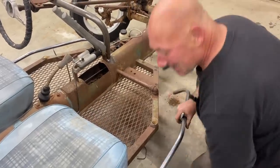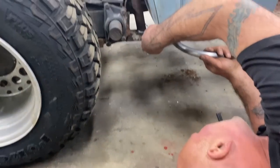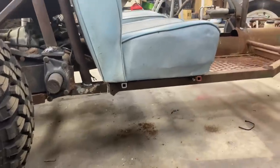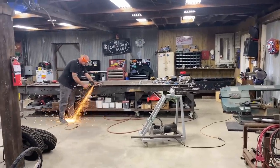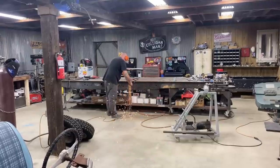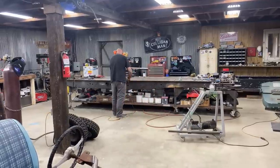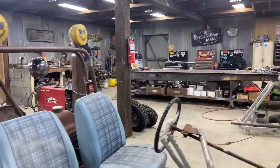like so. Then I'm gonna get under here because we got some big old lug of steel in our way. Let's see what we need to do here. I'm gonna cut this off like that, like that, and like that. Where I cut those seat belt mounts off, there's still a big lug of steel there, and I'm just gonna leave it and weld to it because I know it's dang strong. Prepare to cut. Do a quick cleanup on the rust on this thing, and we shall fasten it with liquid metal.